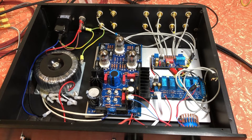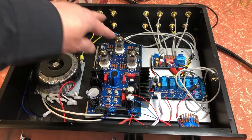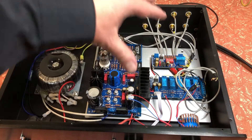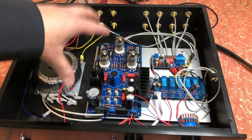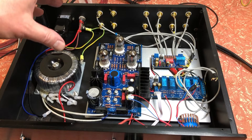Really I've gone about building this thing the wrong way. I thought I'd do the simple parts and work up to the complicated part. What I should have done was build the preamp board first, test it, get it working, and then add the other parts on. Because basically what happened is I put it all together and I have this hum, so now I've got to troubleshoot it, which means I've got to backtrack a whole heap of my work. If I'd built the preamp board first and got that working, then added something else and the hum appeared, I'd know where my problem is.